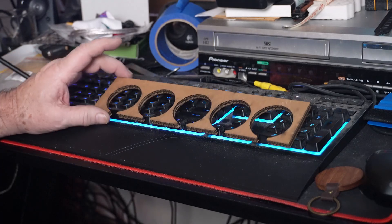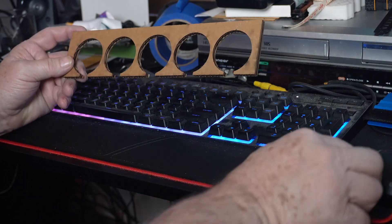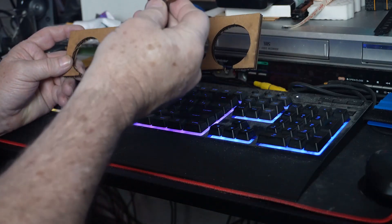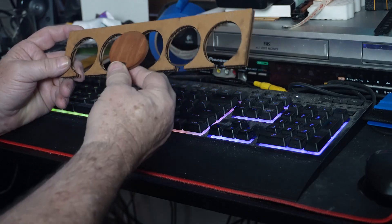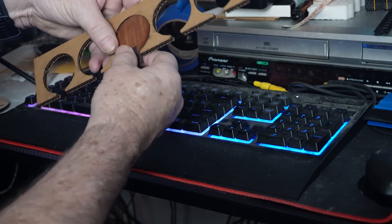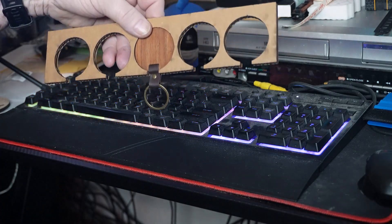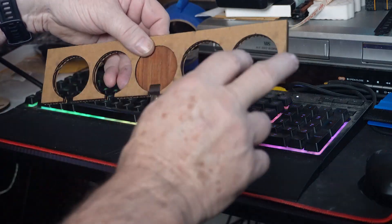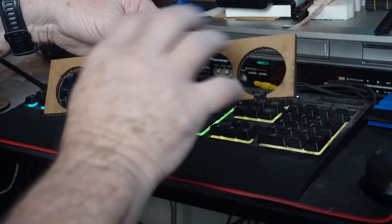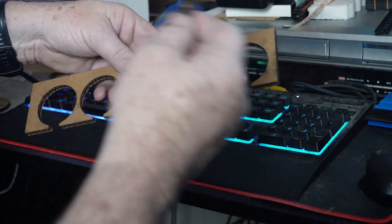So here's the jig that we cut out on the laser. You'll see how it works — this is going to be upside down so all my graphics will be upside down, but you just slide these in, lay this on the laser where you know it needs to be, and just slide these in until you've got five of them across there. Then go ahead and do your engraving, pop them out, put five more in, and continue on.